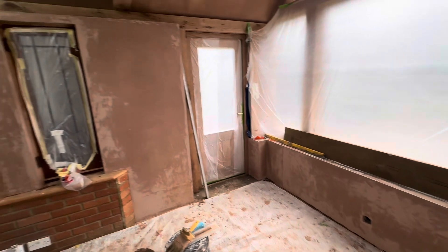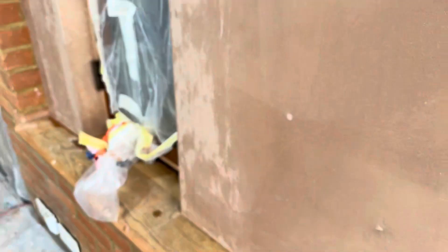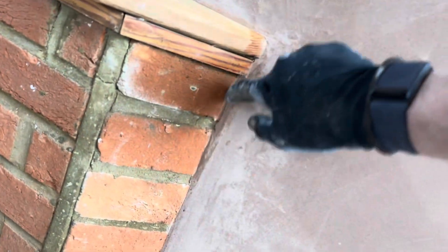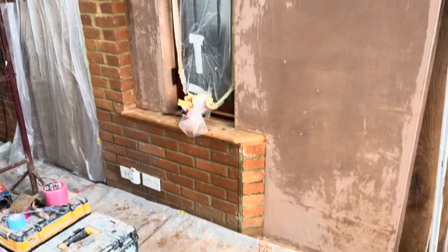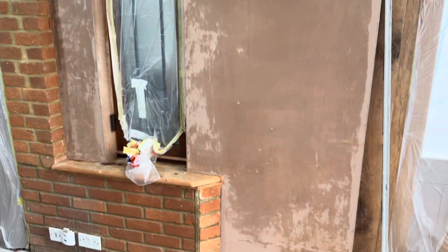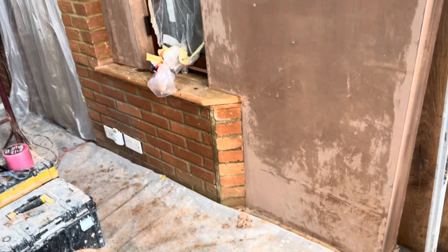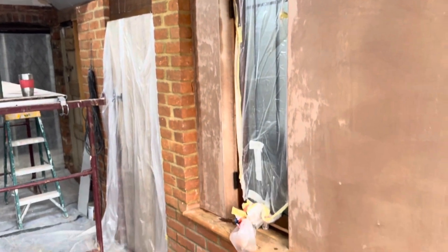And that is now all finished. There's a lovely detail — I really do quite like these details around here where you're matching in; it's the plaster running right into the brick, it looks less decorated. I do like those details. But it's areas like that where tape is so important, because even with the best will in the world, if you don't tape it you're going to struggle. You might be amazing and be able to keep it clean, but most of us humans are not going to be able to keep that as clean without masking tape — or as I should have said, brick tape.